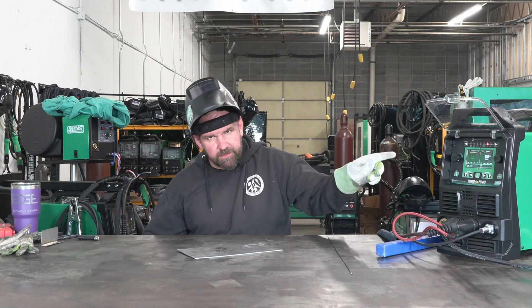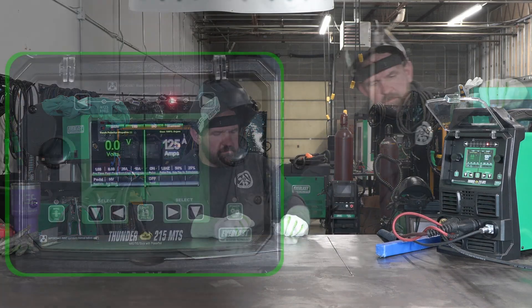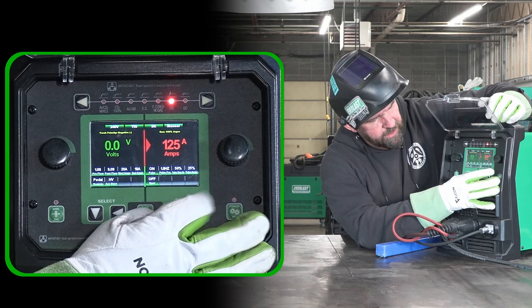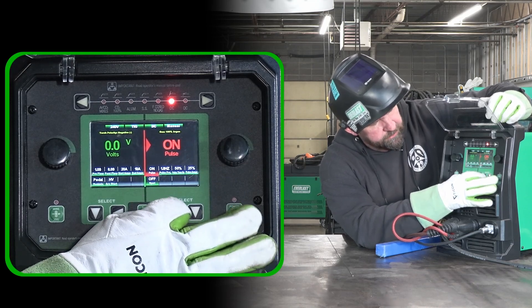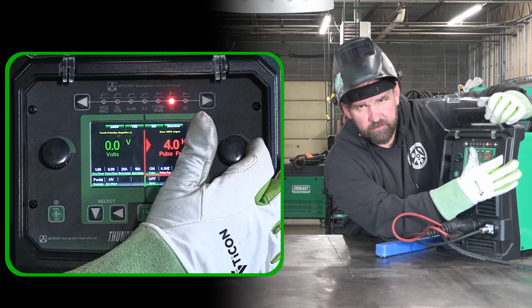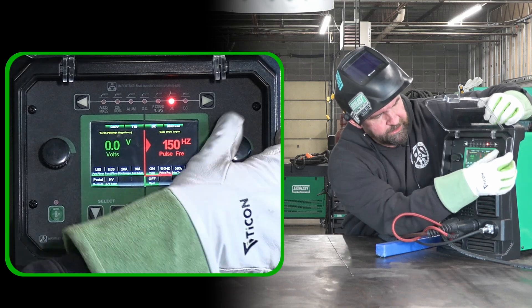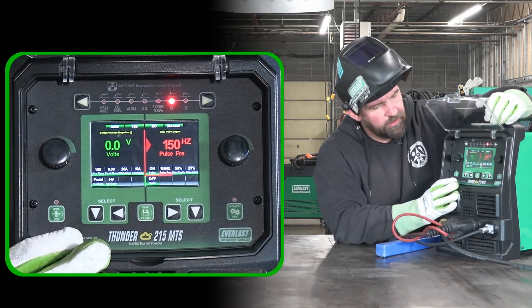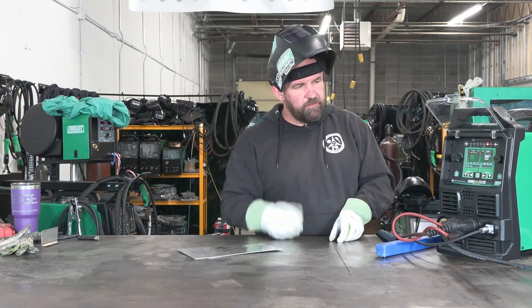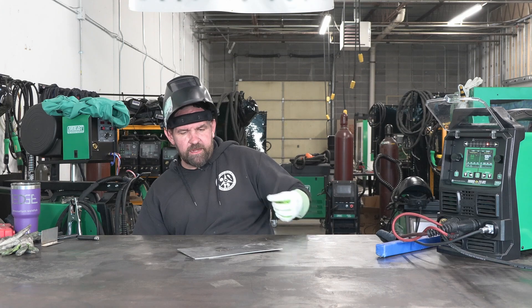Filler is a little big so we don't need to zoom in on that — probably should go down to some MIG wire for what we're doing. Back to the control panel — press the down arrow again, we don't want to adjust amps, we want to go to our pulse frequency. Press the over button. You can do a fine adjustment by just rotating the knob, or push in and hold to go up by tens. We can go all the way up to 150 Hz — 150 pulses per second. This thing will actually start to scream at you a little bit.